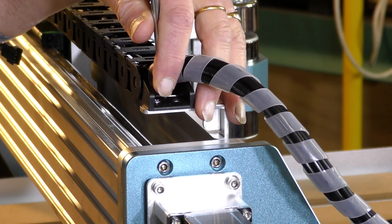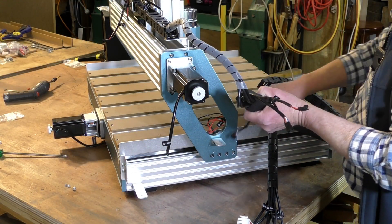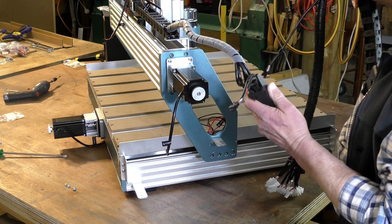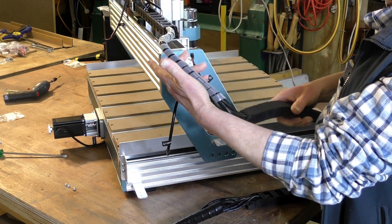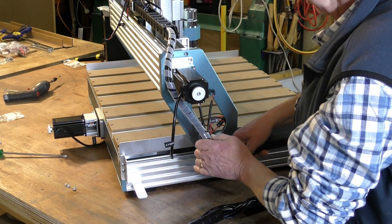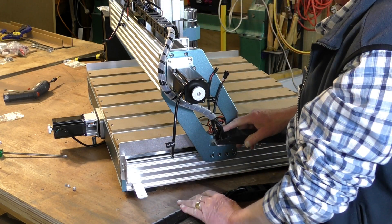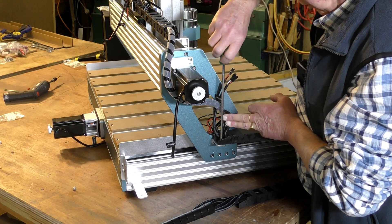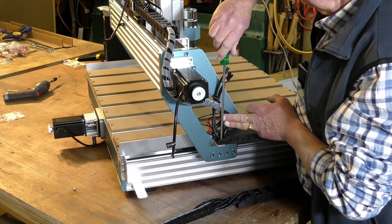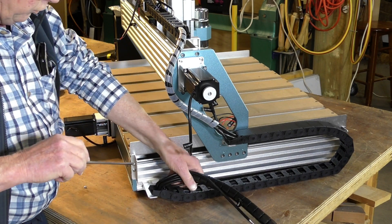As this is going into plastic there's no need to jam it up super tight — firm is okay. I would suggest to wrap the cable around the back of the stepper motor, the X-axis stepper motor, and we'll screw this on here. This is actually the easiest wiring job I have ever done for a CNC router, simply because all the work is done for you.